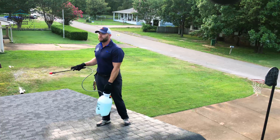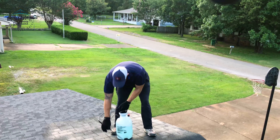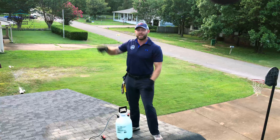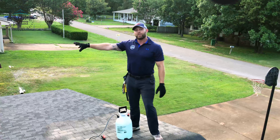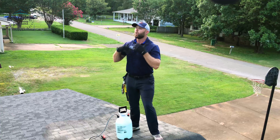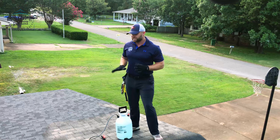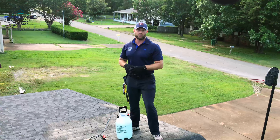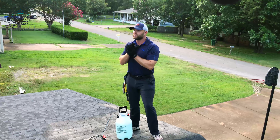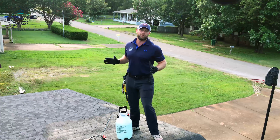It's probably not going to work on your first time. You're going to spray everything down — sweep it, spray it. When you get off the roof, make sure the last area you apply chemical is right by the ladder so you're not walking on a wet roof. Then spray everything down with water again, including all your vegetation, and wait for a rainstorm. Once rain comes, go back on your roof and see what it looks like. Most of the time this takes two treatments, particularly when using bleach, water, and dish detergent. Do the same thing a second time, and after the second rainstorm I guarantee it's going to be a hundred times better than before.